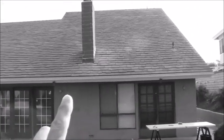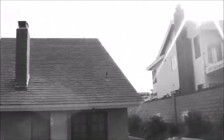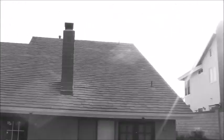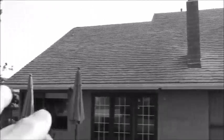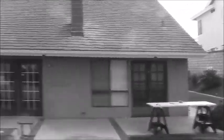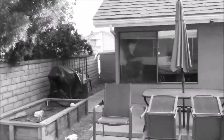For such a long run, I really should have had one downspout on each end, but because this side is more of a walking path across the house I kind of like it with just the one downspout. Technically with so much roof area and such a long distance it really should have been done in two, but I left it set up for one — keeping that side free of obstructions, trip hazards, and walking hazards, since that's the side we always walk around.